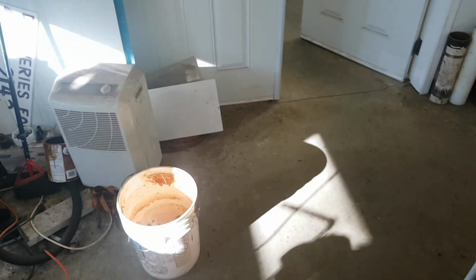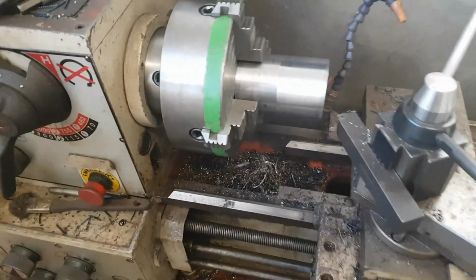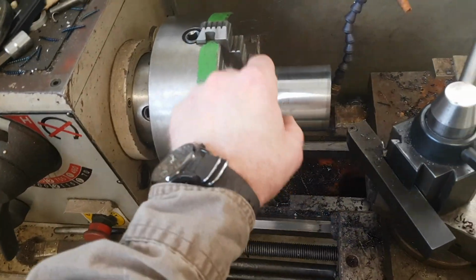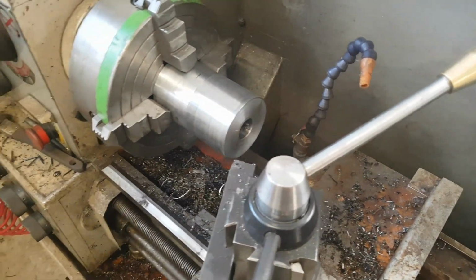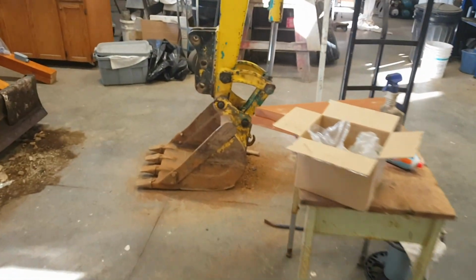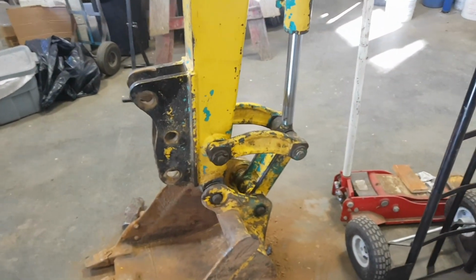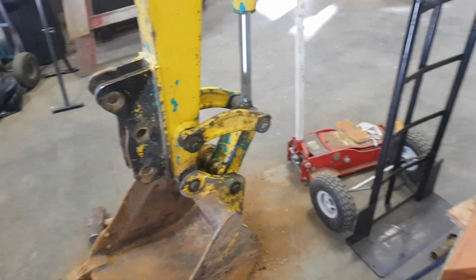And I got to get a little bit more yet. So, oh yeah, I still got this slug in here. So this is some more than 90 mil material. Punched it out to 1 inch there, and the shafting on these pins here is, well, it's a 35-ish millimeter bushing, but the bushings are slightly oversized. So what ends up working out perfect is 1 3/8.